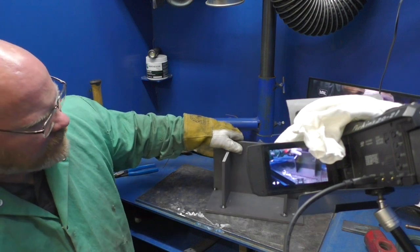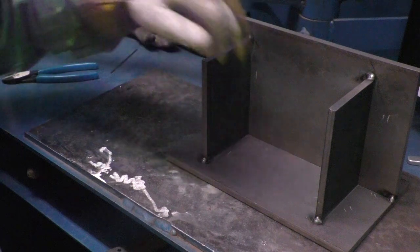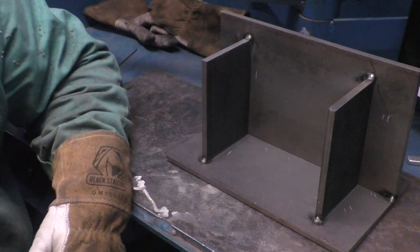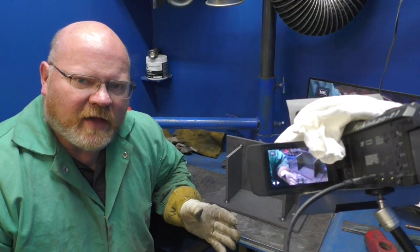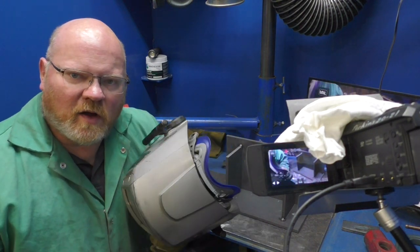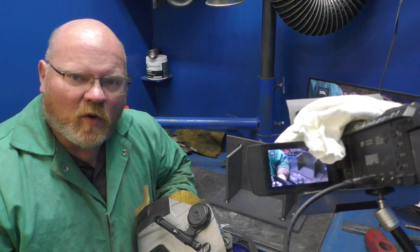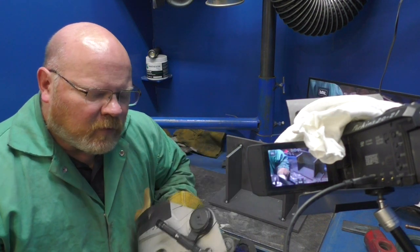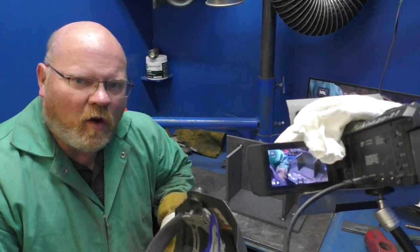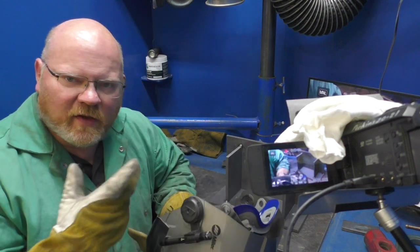You'll notice that I have a toe bracket assembly and in this assembly there are sharp corners — there are no snipes in the corners. At the yard you would never have a corner that comes together like this. There would always be a hole through so that primary hull structure could be welded first and then secondary hull structure welded afterwards, with the weld wrapped through the hole. But for students learning, if you're building something that's got to hold water — air tight, oil tight, water tight — you're going to build it with tight inside corners.